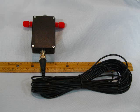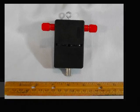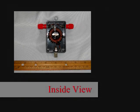That'll be a perfect length for your camp site or bug-out location. At the present time I have not waterproofed this balun, because I'd like to have an opportunity to put the antenna up and check it with an SWR and antenna analyzer to see if it's alright. If it is, I'll seal it up with some silicone and it'll be ready to go. The rear view shows two black cable ties that go through the back case into the balun, holding the FT-140-61 ferrite core toroid in place to keep it from rattling around. The inside photograph shows it is a very simple wiring job.